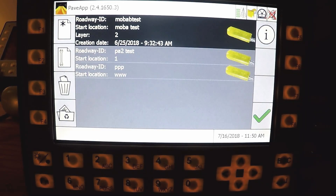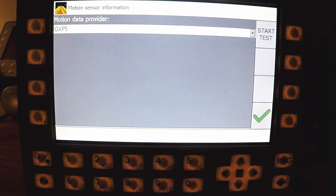We're going to cover button functions, icons, some quick tests, project entry, and project start. Starting with the icons in the top right portion of the screen: the satellite dish symbol is your GPS reception — currently it has an X through it since my antenna is inside the office. Once you've established a GPS connection, you'll have a green dot to the bottom left of that satellite dish symbol. The next icon is for the odometer — a quick test. Press the odometer symbol, select start test, and slowly turn your odometer; it will read out a building distance and your current speed to ensure everything is connected properly.